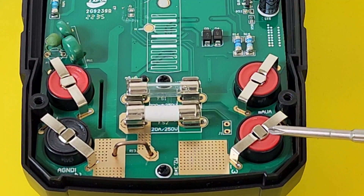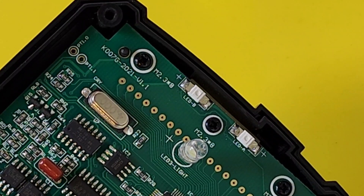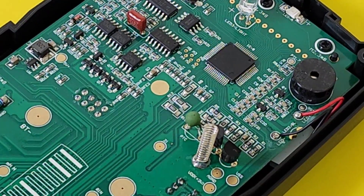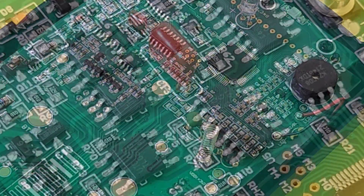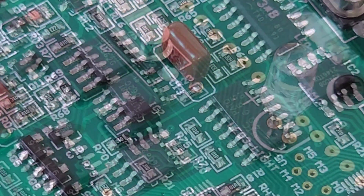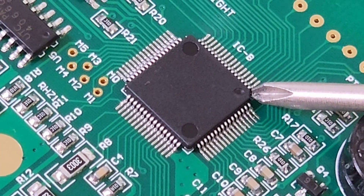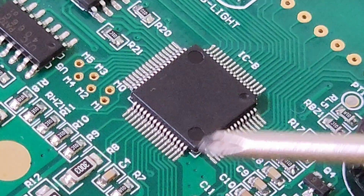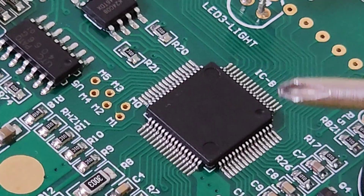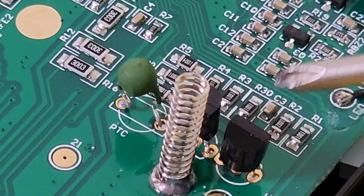Those input jacks are not just the split variety — these are a step up. Top of the meter shows a 2021 fabrication date, version 1.1. That big spring is the grounding spring making contact with the shielded metal inlay. We have UTC semiconductors — three op amps, and a UTC 4066 quad bilateral switch. One chip appears to be a quad flat package but is completely void of markings — not cobbed, but no data markings. There's another PTC at the top, almost in series with some transistors.